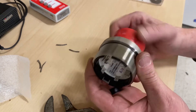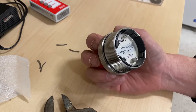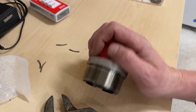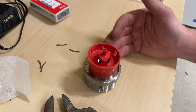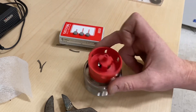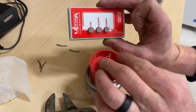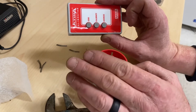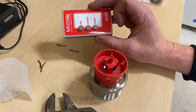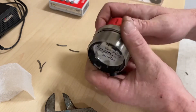We'll go downstairs and install this sensor. As soon as we install this, the O2 level might be high — usually it ends up reading about 25% until the sensor warms up. As soon as the sensor starts warming up, the oxygen level will keep dropping to the point where it will probably go into alarm. It will drop below 19%, and you've got to go back and recalibrate it.